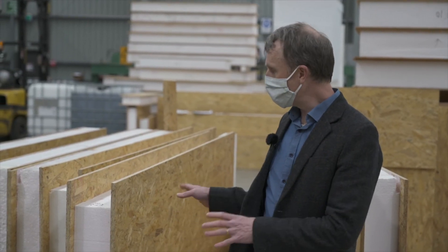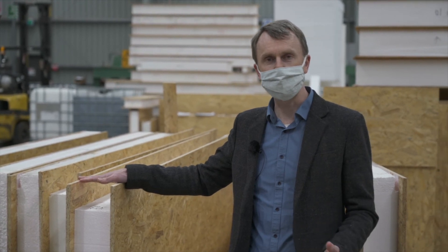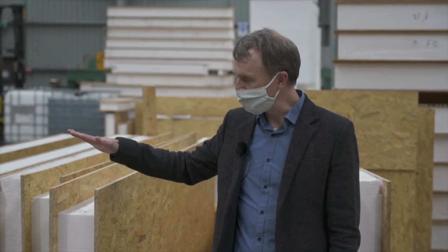We've had a look at how the wall panels have been made and we've had a look at the roof panels. Our job lot is almost ready to go, so hopefully later in the week these will all be lifted onto the back of a truck and delivered to our site about 20 minutes from here. The slab is ready, the walls can be fitted onto their bottom plates and the roof erected all very quickly. When the building shell is at lock-up and waterproof, builders and other trades can get on with jobs inside and outside, and the process should be quite quick from there.